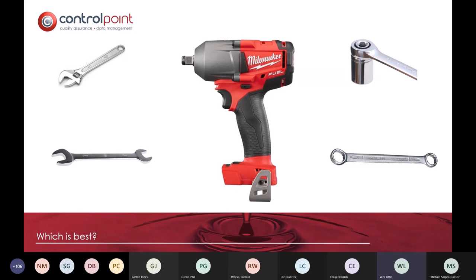If you've been to site and you've seen an engineer use a hydraulic, or a pneumatic or a handheld battery drill, you'll notice they'll buzz the bolts up, possibly not in any kind of order. They might go just round as how they think it should be done. And then they'll go back round with a torque wrench. If that torque wrench clicks before they've even moved it a few degrees, I can guarantee you that that torque is too high for that bolt set, because there are no controls over it. There are products available, but they are quite expensive in relative terms.